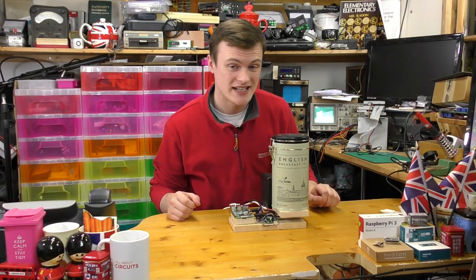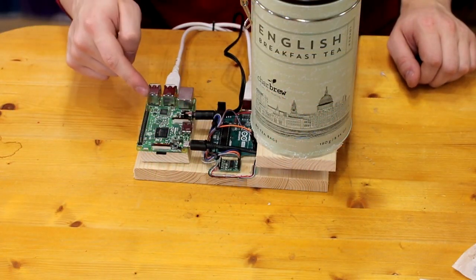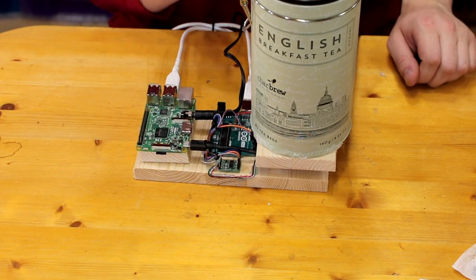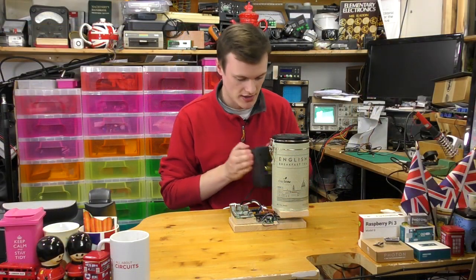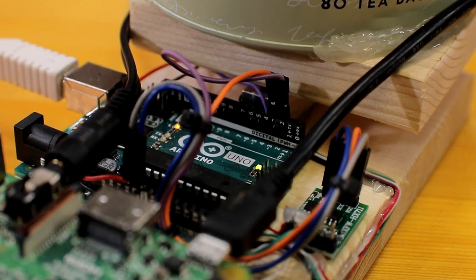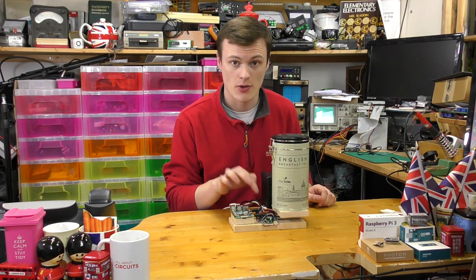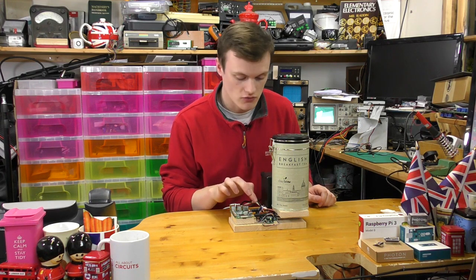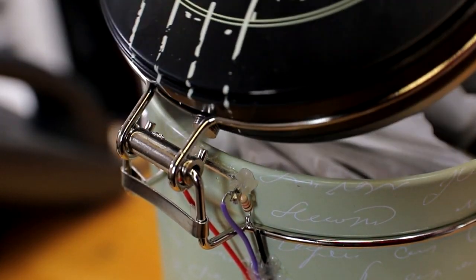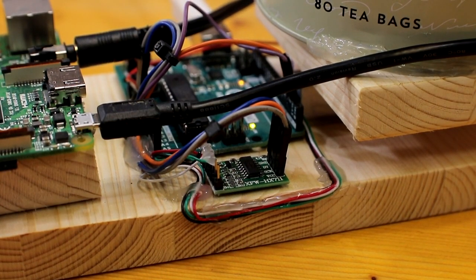Now that we've completed the IntelliTea system, let's see how it's put together. The Raspberry Pi computer produces responses depending on how many bags are remaining in the pot, and is also connected to a speaker hidden behind the pot. We then have the Arduino Uno, connected to the Raspberry Pi using a USB lead, which acts as both power and a communication link. The Arduino Uno reads a small reed switch on the back of the lid of the tea bag pot, but also reads data from the load sensor ADC, the HX711.